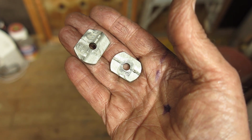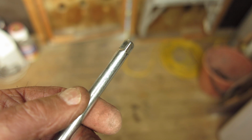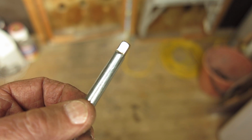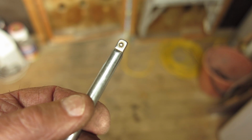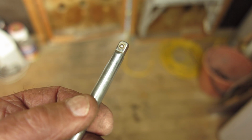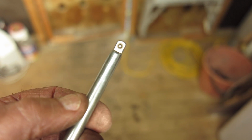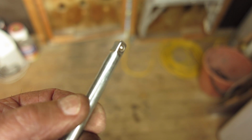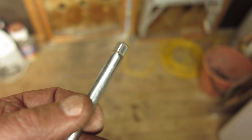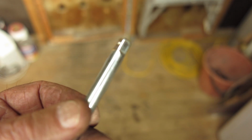So I'll do that. This is what we've got to fit. Quarter inch square drive. Now, I find that filing the holes out, you need a snug fit. That's what we're looking for. I don't particularly need that whole squared end to go right the way through that tool. I prefer it if it didn't. We just need good engagement all the way through that plate that we've just cut, really.